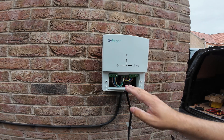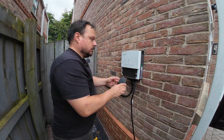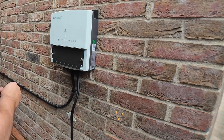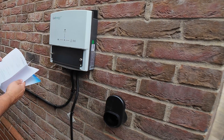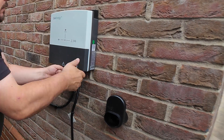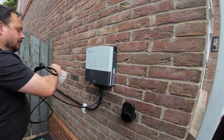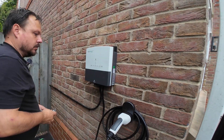This all does cloud sync — I'll show you the app and how all that goes together. Get the front on, get it all weather sealed, do the testing and I'll jump back and show you it's been commissioned. So you can see here we've got the holder to pop on there as well, just to take the charging cable and keep it securely held in position — there are three fixing holes for that. Similar process with plugs and screws, and then you can coil away your cable around it and it will hold the charge plug as well. As always, just checking the manual to ensure everything is in position. A final check over of all the bits and pieces before we run through the electrical testing and commissioning the system. It's always worthwhile giving the cable a wipe down — they tend to collect a little bit of dust from the drilling and such, however neat and tidy you try to be — just to make sure it's clean for the customer.